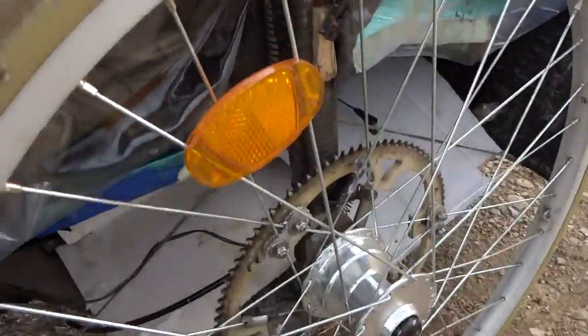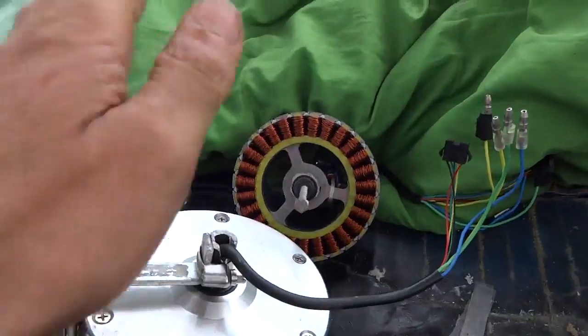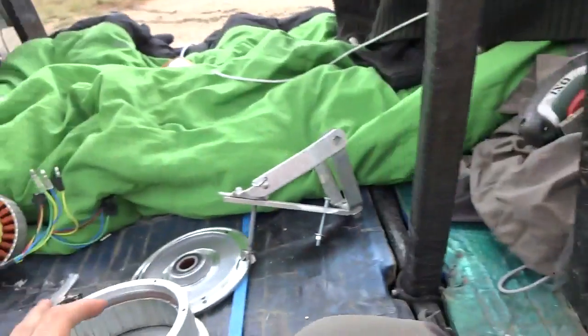It's working and it's very silent — I'm very happy about this improvement. Previously I had an RC helicopter motor at 225 KV (RPM per volt), but these are only 14 KV — 14 RPM per volt. So I don't need a planetary gear for these motors and can directly drive the sprocket — that's why they are super silent.